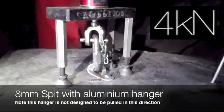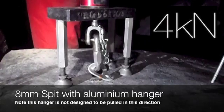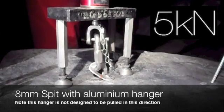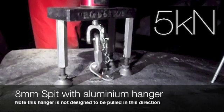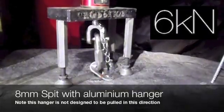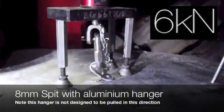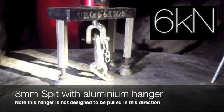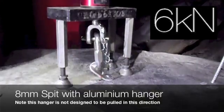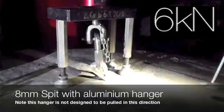Four. I'm going to try and get it up to six and leave it at six for 15 seconds if you can. Five. It's just bending that plate isn't it? Six. Probably at the end of the travel arm isn't it? It's my hanger actually. So that's six there isn't it? Yeah, it's not moving. So it is just the bending of the plate. So you wouldn't choose to rig it like that because you'd bend your hanger. Actually it probably wouldn't break. That's good news as well isn't it?